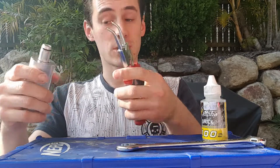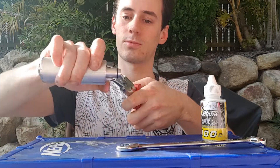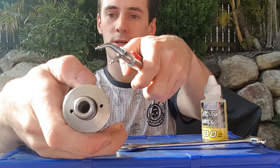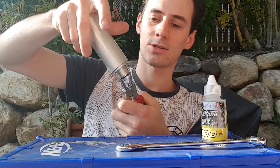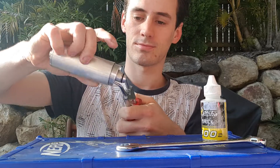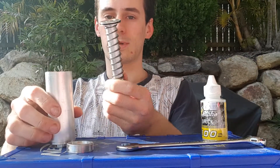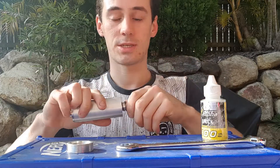You will need some sort of long nose pliers — I use circlip pliers — to open the front end. Just put your two circlip plier points into the two holes in the front of the Supercore and twist. The cap is not tightened on too much, it should come off fairly easily. Then you should be free to pull out the piston — nice and smooth. If it does not come out smoothly, there's something wrong.